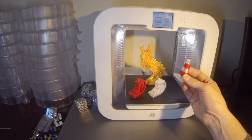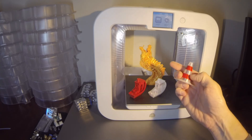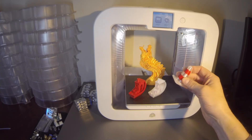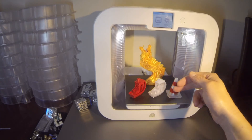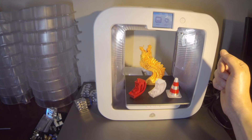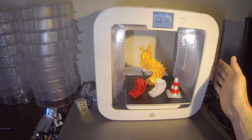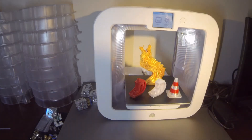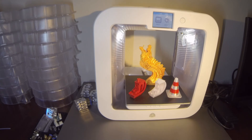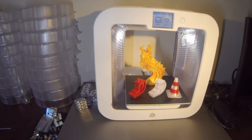This is a two-color print — really happy with how that came out. I did just a little bit of post-processing on this; something happened over here with some pieces of filament. Another great option: with regular Cube 3 firmware you can add what they call Infinity Rinse Away, which is just PVA. So you can do PLA prints with melt-away support material — throw it in some warm water, about an hour later it's all gone, and you have very hard-to-print objects completed.